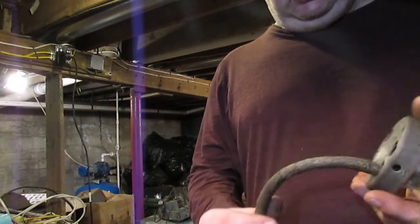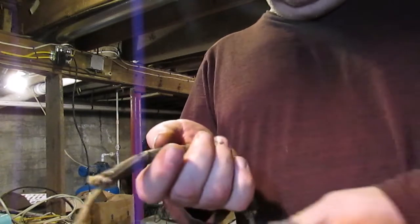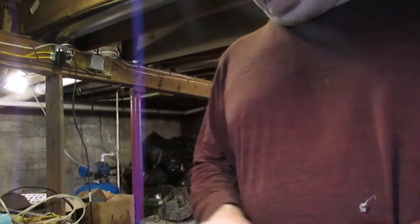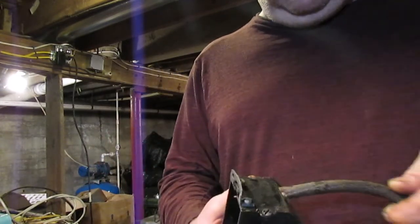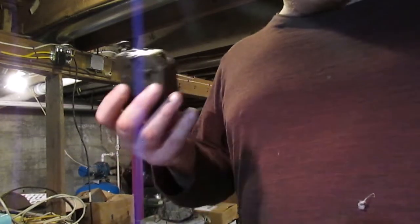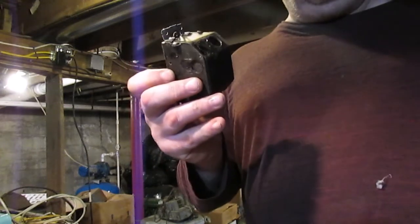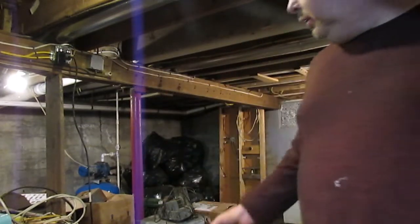As you can see, that's a piece of protective loom that they installed to protect the wire where it went into a junction box. And they also used that in this old-fashioned knob and tube switch box that I took out of this house, to protect the wires from contacting the metal, because obviously there's no ground. So if a live wire happened to come in contact with this, the whole entire box or the light fixture or whatever would be live with power.